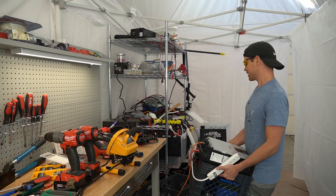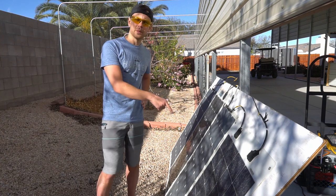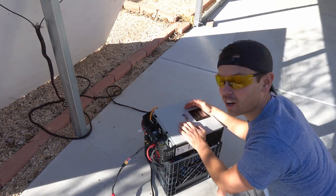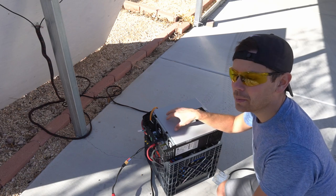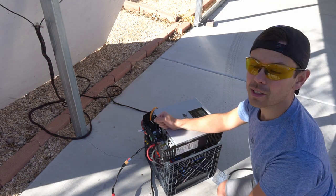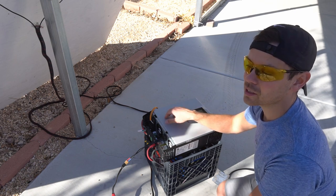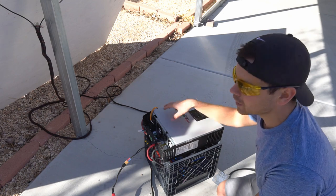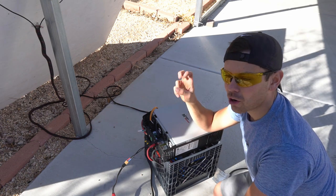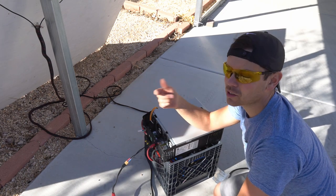This thing is like 60 pounds, which is ridiculous. On this side of my backyard I have a solar array for charging my golf cart — it has a voltage open circuit of 84 volts, and I added an XT60 connector so we can connect to it. We are charging off solar now. What's nice about this all-in-one is the MPPT's max open circuit voltage is 102 volts, compared to the EB240 which is like 50 or 60 volts — almost double the capacity. That means you can have all your panels in series. This can only handle 500 watts, so five 100 watt panels in series should work great. Right now we're charging, but it is charging very slowly since the sun just came up.